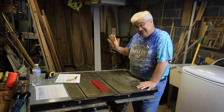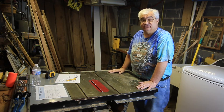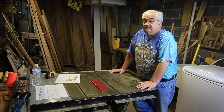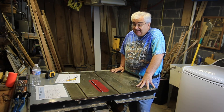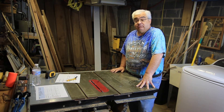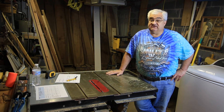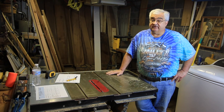If you're near a lumber yard you may not need to buy as much extra since you can run right back and get one. Just realize that everybody makes a mistake cutting a board, and that infamous board stretcher tool hasn't been made yet — once you cut it too short, it's too short. If you're working with oak, maple, poplar, or pine, maybe you roll the dice and don't buy that much extra because your home center stocks that lumber. But if you're using cherry, walnut, or exotics — which are expensive — you really want to be on the ball with your measurements.